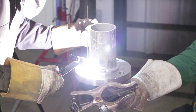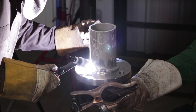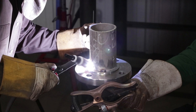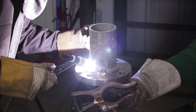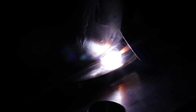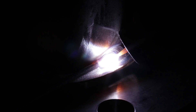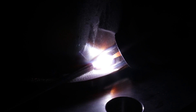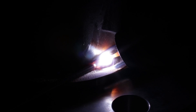Now I'm gonna show you how to weld these flanges. It's not so much walking guys, it's more wiggling the cup. I'm wiggling the cup especially for the root pass. We're throwing two passes on these flanges — a root and a hot — and that's it. For the root I do very little wiggling, but making it as tight as possible for the wiggles.